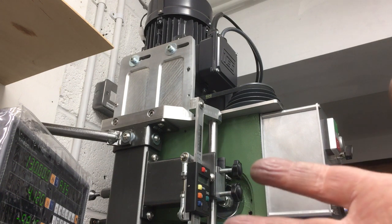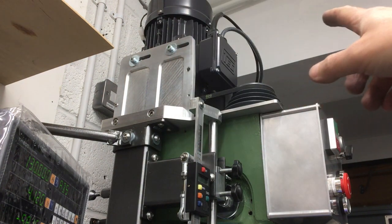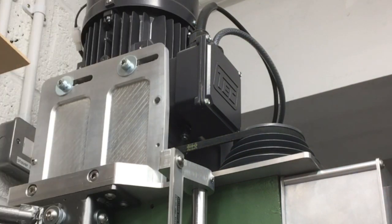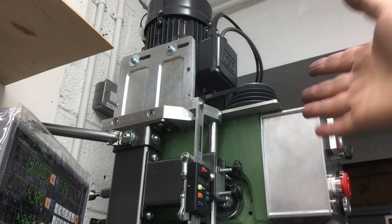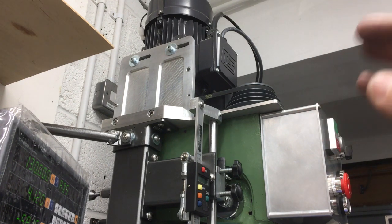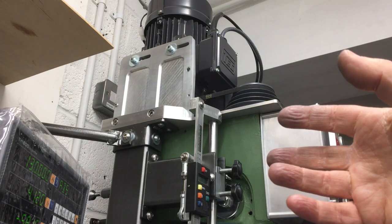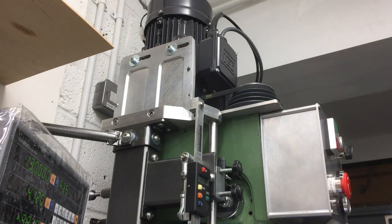So I thought about other options. I could have made it out of sheet aluminium, but then make it a folded shape. But then this seam down here was not going to be easy to do. My welder only welds steel. I don't have an aluminium capable TIG welder. I could have put some tabs on it and then riveted it together, but that doesn't look very nice, I don't think. So what I finally decided to do, I ordered some sheet steel. I'm going to make the whole thing out of sheet steel so it'll be folded, and then I'll gently tack this final seam down here, around here, and then grind it back and try and make it look nice, and then we can just paint it up and hopefully that'll do the job. Now the sheet steel for that, 500 by 500, so enough to make this and plenty spare, I think came to about £16 delivered, so way cheaper than the aluminium solution. A bit more work perhaps, but I think it's still going to look nice. So let's get on with that.